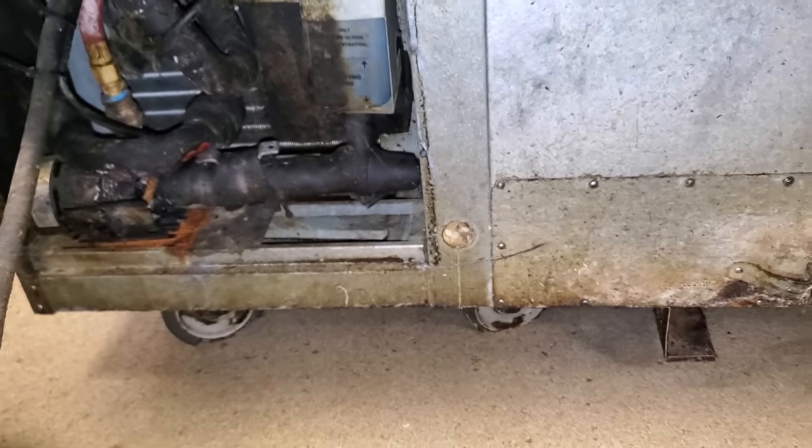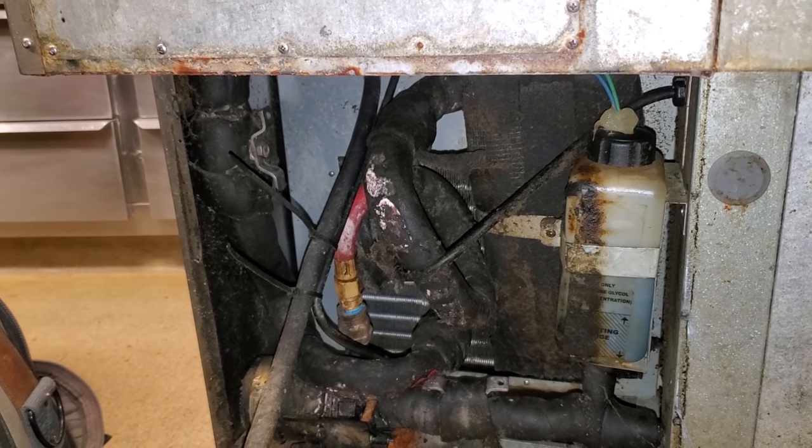We're looking good. I'll tell the customer to keep an eye on it — it'll be at least an hour or two before the unit comes down to temperature, but I'm pretty confident they'll be okay. This wasn't too bad — a pretty straightforward service call. The unit was high in temp as the customer complained. Found it was low on refrigerant, went through diagnostic steps before putting service gauges on — it's a critically charged system so you want to be cautious. Found the refrigerant leak in the low pressure control, ironically the very component there to protect the compressor. Replaced the low pressure control, upgraded the wiring to SO cord, and installed a new filter dryer slash sight glass combo. Vacuumed it down, recharged it — the customer has been happy for about two to three weeks now.